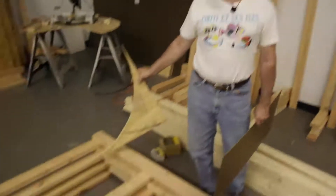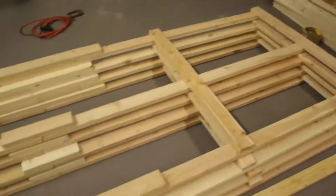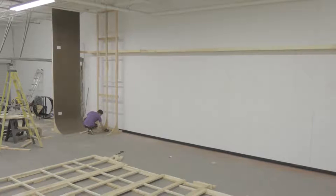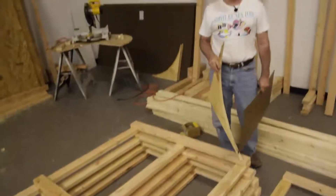We built ours in four-foot wide frames with a two-foot section sticking out of the front, designed so they could be built together as modular units. What we wanted was the ability to deconstruct the wall and take it out in 15-foot tall, four-foot wide sections — still light enough for two people to carry and load onto our truck. At some point we may want to move the psych wall to a different location, so it becomes portable. You break the mud at the seams between panels, carry each unit out, set it up at the new site, mud it back in, paint it, and you're ready to go.